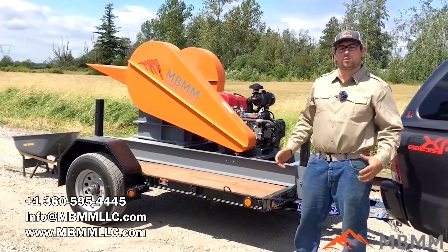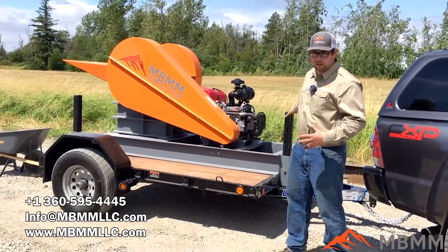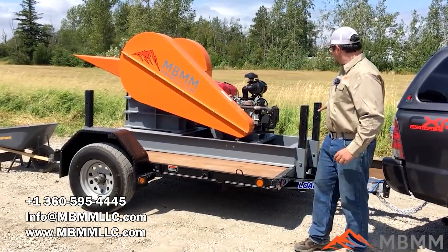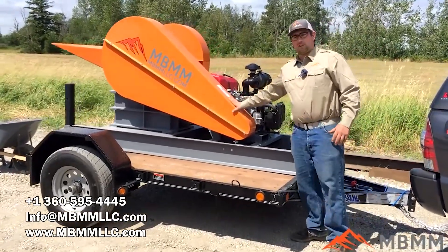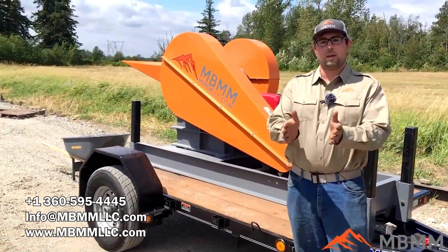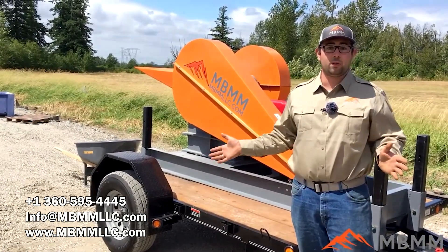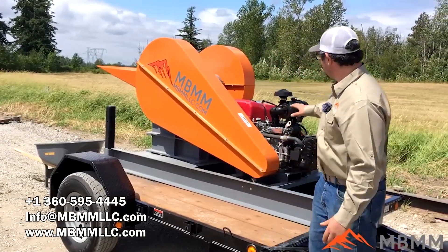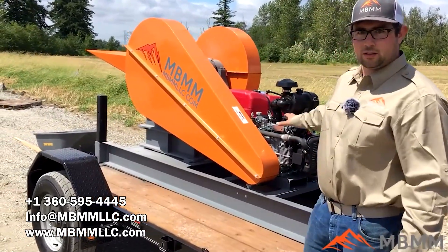The reason for that is that when you're crushing, there's a lot of vibration. And if you didn't have these, the trailer will hop with the springs, so this prevents that from happening. The 8x12 crusher itself can crush between 2 to 6 tons per hour of rock, depending on how wide you have the plates open. They're adjustable from about a 3/4 inch minus up to about a 2 and a half inch minus, and this whole unit is powered by a 20 horsepower Honda gas motor.